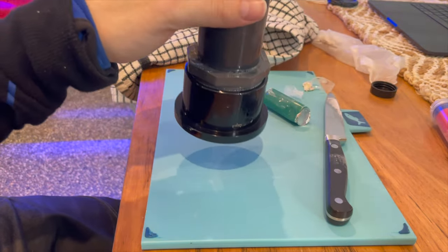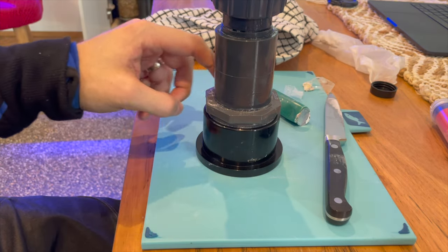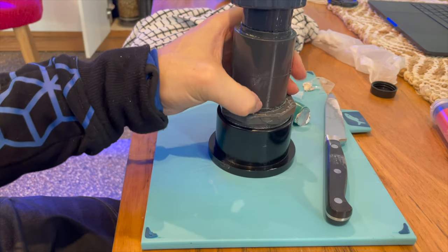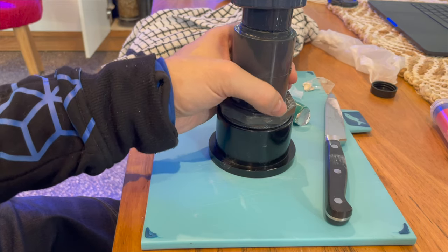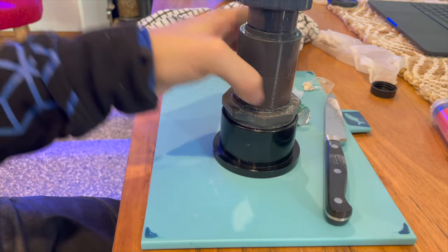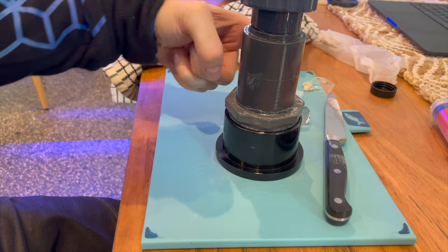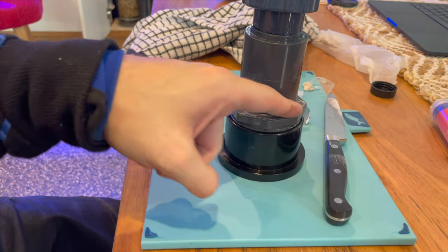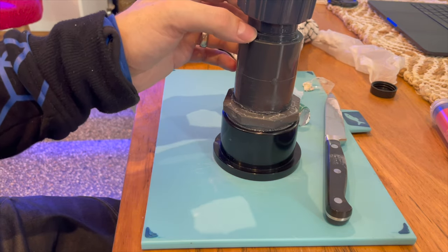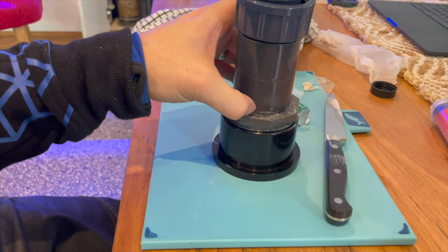But before I leave it, I am just going to reapply primer onto this outside bit here. I'll sand away as much of this dried, crusty, not very well bonded PVC cement. Then I'm going to apply primer. Then I'm going to very carefully and neatly apply new PVC glue all around this joint as well, just to, one, make it look nicer, and two, just as a second double seal, again, attempt to seal from the outside.